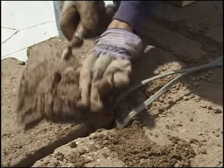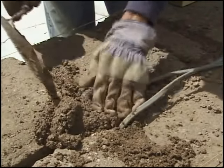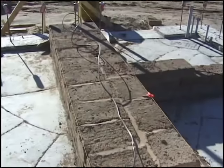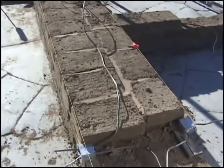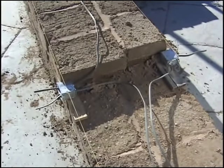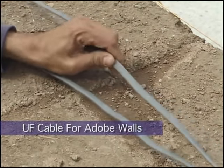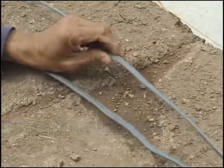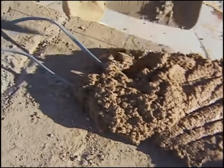The electrical wiring for adobe walls is run right in between the courses of adobe and mud mortar. As you can see here, the wires have been laid out on this top course of adobe, and this actually gets sandwiched in between additional mud and adobe bricks. This is called UF cable — it stands for underground feeder — and it's meant for burial in the earth, which is what's happening here when we place mud on it.